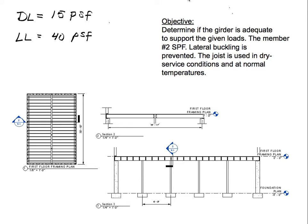For this video we're going to determine the maximum moment, the maximum shear, the maximum reaction, and the required inertia. Once we find all those things, we're going to find the section modulus of this girder, we're going to find the inertia of this girder, and with those — along with the area — we can find the moment capacity, shear capacity, and deflection capacity of the girder.